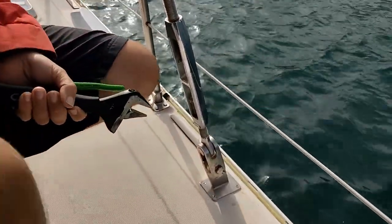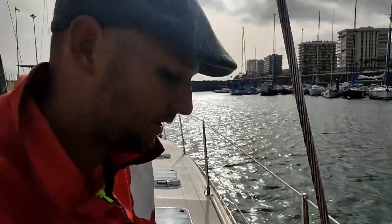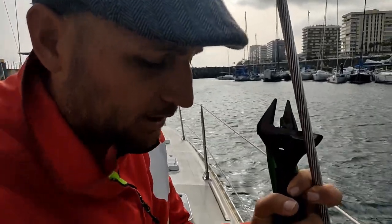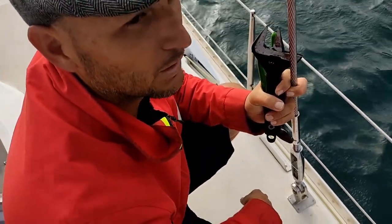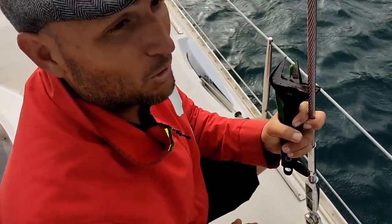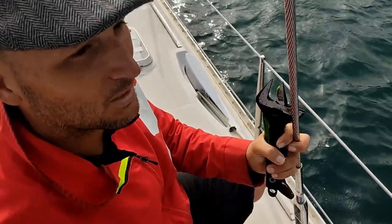We had a little issue — the way we discovered the chain plates are moving. The other one moved, this one hasn't moved yet, but it's something that's been happening on the boat for a very long time. Because I've only just sealed up the deck plate with the chain plate not so long ago, it's very visual that it's happened. Whereas before there was no indication as to whether anything moved up or down, but now that I've glued it there's a very clear definition of if something can move — it's highlighted that there's a problem.